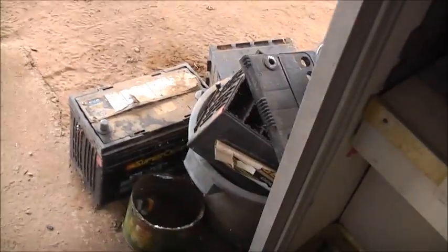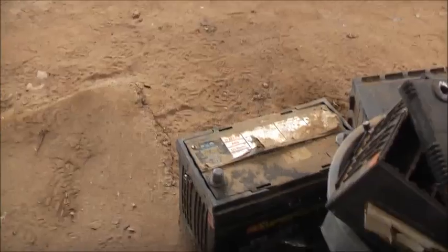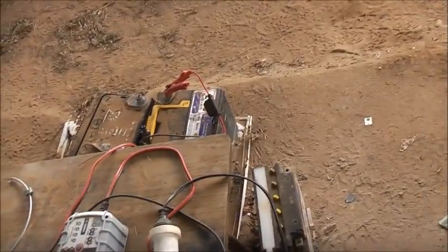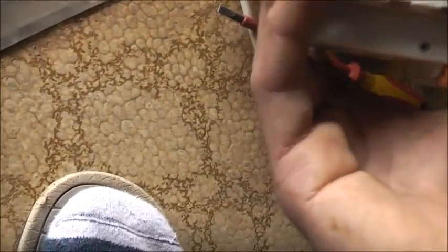Since I don't have another Allen battery like that one, and that one in a repair failed so badly, I just cannot get that battery to charge properly anymore, because I've tried so many different screws in the repair to interconnect the strap, and I've worn it out so much there's not enough lead to bite into it anymore — so that battery's gone. That other battery, the TCM one's too weak for this bank, so I need another bigger battery for that bank to run this ZVS properly. Because 24 volts isn't enough — I need 36 volts, a damn good 36 volt source in this ZVS in order to pop things on this bank really good. This takes too bloody long — it's got to be on 36 volts, high powered.